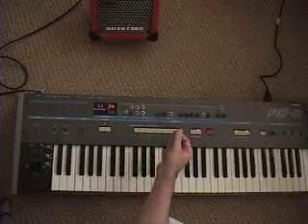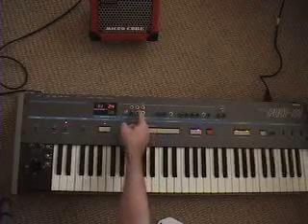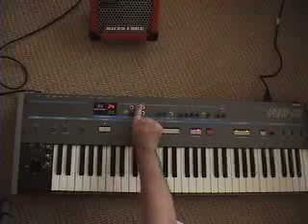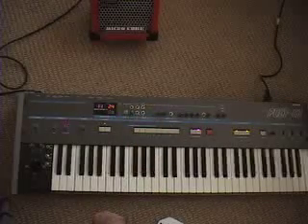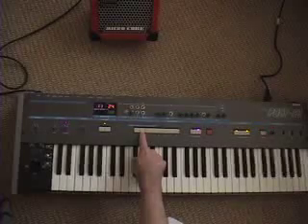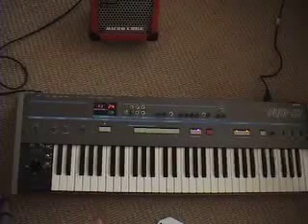On DCO2, what I added was the ability to switch in various harmonics from this truly digital oscillator. Here's the 2 foot, here's the 4 foot, here's the 8 foot, here's the 16 foot. Switch them all on and you get kind of a quasi-sawtooth — that's stock. And then you can actually detune that in a very gradual sense, so I've got that set up here.